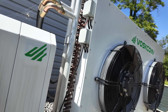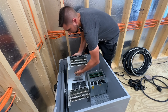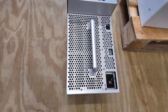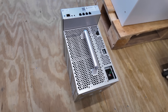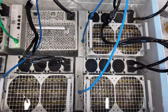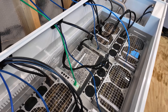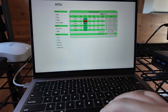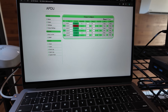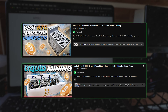If you do that in this era, there's only one single miner I would buy — unless you're getting old gear like the S19 series, which has proven durable in immersion mining deployments. I'll be picking up the Canaan A1566 immersion-ready miners. These things are literally built for immersion, they run on single-phase electricity, and you can just grab them and drop them in. They look good, they work well. The only thing to watch out for is they are absolute energy hogs — they'll use a lot of electricity and suck up all of a 20-amp circuit. Depending on your outlet deployment and PDUs, just keep that in mind.